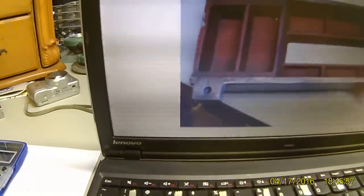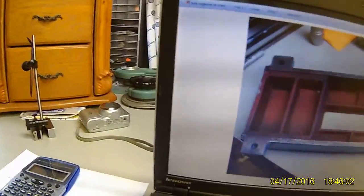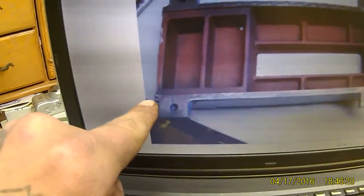When you've got it all apart, I take the base part of the table — if you guys can see this there's a nice little squiggly line and some X's over in the corners. I'd suggest taking your hand scraper and razor blade and scraping those real good — make sure you get all the grime from the factory. Sometimes there's paint overspray, could be anything. Just get them scraped down real good.